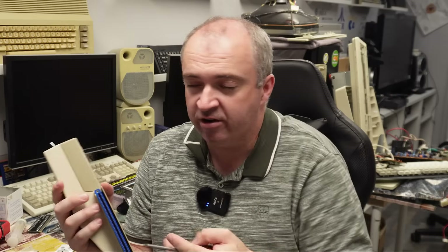But if these are indeed faulty, here is a thought - what would this do with these chips removed? Would it show any more signs of life? With the TAG RAM chips missing - nope, it's still just a black screen. I think that is more or less now confirming that the fault is indeed within the PLDs. Let's go ahead and try fitting the two new TAG RAM chips, and fingers crossed we get a little more activity out of it.